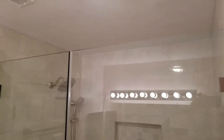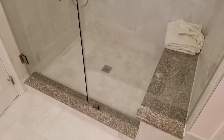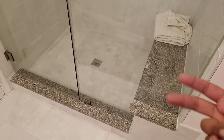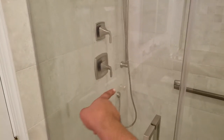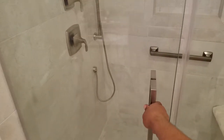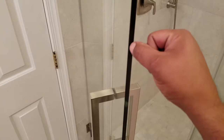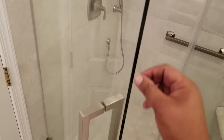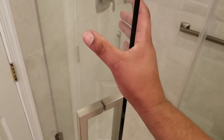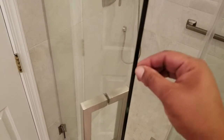This is also the type of glass that's used 9 out of 10 times on most projects. I'm mentioning this because in contrast there's low iron glass where you don't see this greenish tint going through this direction. While you may see some slight greenish tint on the edge work, it's obviously not this dark. The whole idea of low iron glass is not about the edge work itself, because the glass still needs some iron in order to be created — so you will still see some green on the edge work.